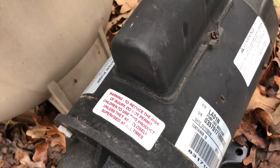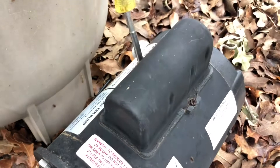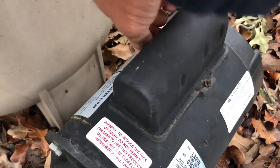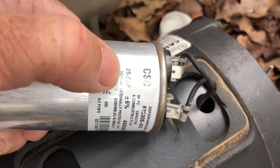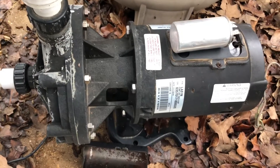Let me show you real quick how to fix that. There it is — this one's for a booster pump, and you can see the numbers on there. It is a 25 uF or 25 MFD capacitor; that'll take care of the Pentair booster pumps. Most of your bigger pumps, two to two-and-a-half horsepower, are going to have a 30 or 35 micro farad MFD capacitor.